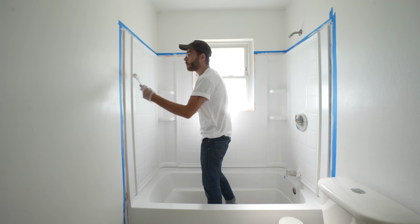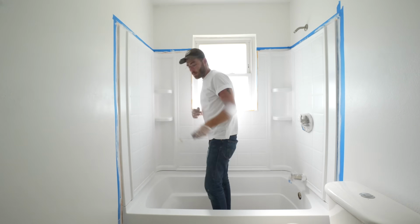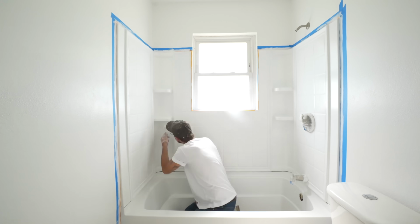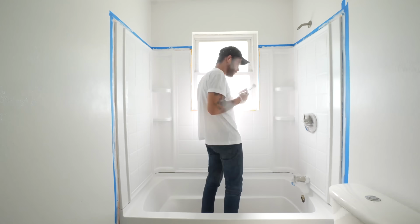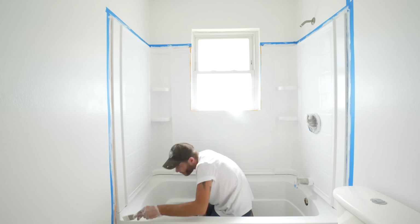Second coat is complete, and I know now that I'm gonna have to apply a third. I think if this tub and shower was pretty much all flat, I wouldn't have to do this. In my shower, on the flat panels, I've got pretty much 100% coverage, but this shower has a lot of contours on it, so I hope that with a third coat, I'm gonna be able to be done. I put the stopwatch on, and it basically took 45 minutes to apply a really good, even coat. Really make sure you're careful around all of these corners and edges, and it's helpful to get a brush around some of those really sharp radiuses.